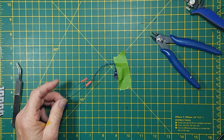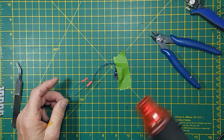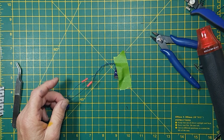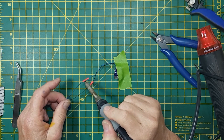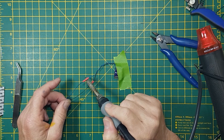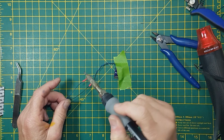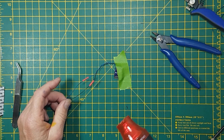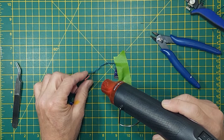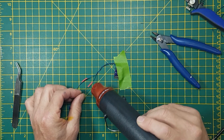In this case I've got a little hot air gun — about 10 pounds on eBay or something like that. But you can use, if you're very careful, a match, or the edge of a soldering iron — just using the shoulder of the soldering iron. You can see the heat shrink is gradually shrinking down. But it is better with my little hot air gun, just to make sure it's now nicely stuck in. Just get a little roll with the fingers to make sure the glue sets.